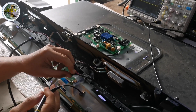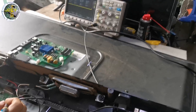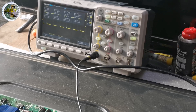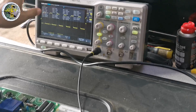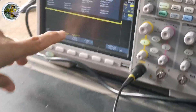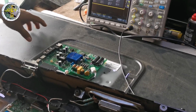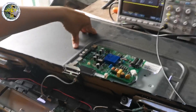If you haven't subscribed yet to my channel, please subscribe, and don't forget to like, share, and hit the notification bell to be updated when I have a new upload. After connecting the VGH odd and VGH even going into the LCD panel to the VGH supply, I checked the clock signals and only the Clock 3 and Clock 6 pairs show a slight difference from the two other clock signals.